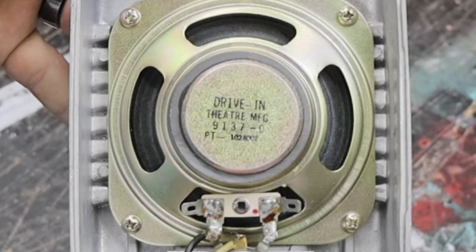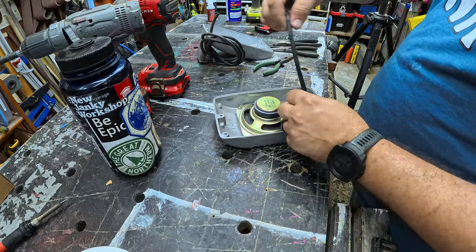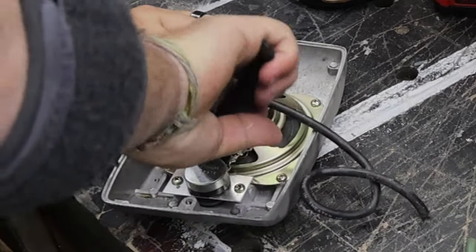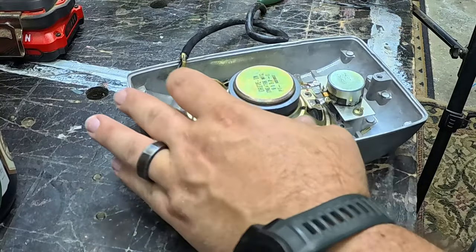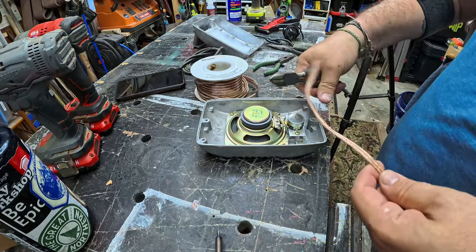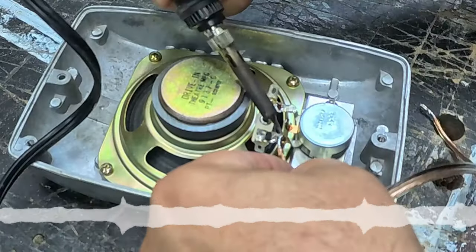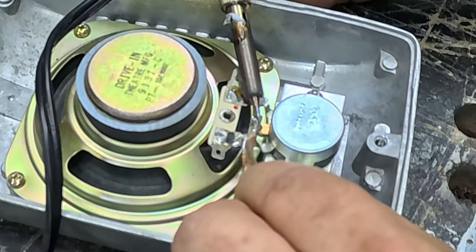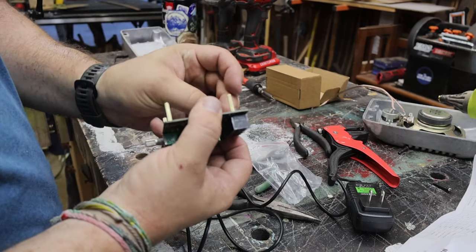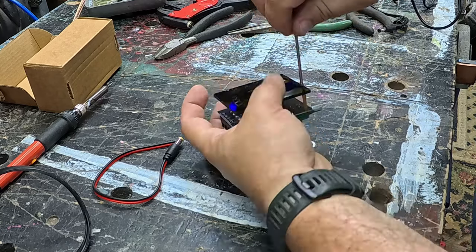Here's a little shot of the inside. I had to snip off the speaker cable because it was so baked and old and crunchy, it just had to go and be replaced. So I took this new speaker wire, soldered it to the contacts, then I added the risers and base plate to keep the amp off the aluminum body of the speaker, so there's no condensation or anything like that that could happen and muck up the electronics.